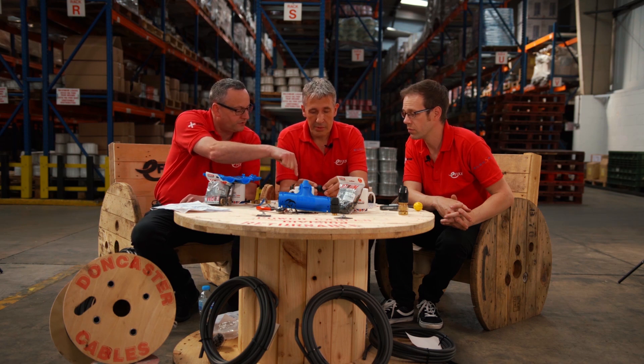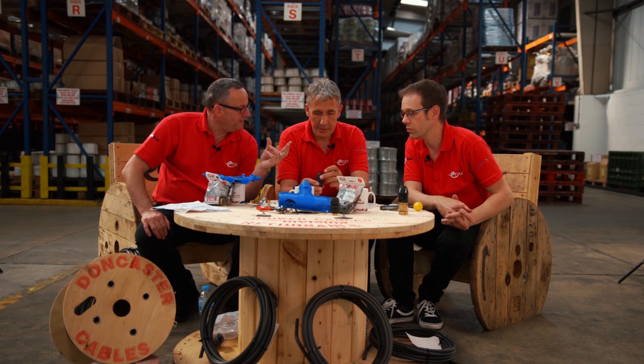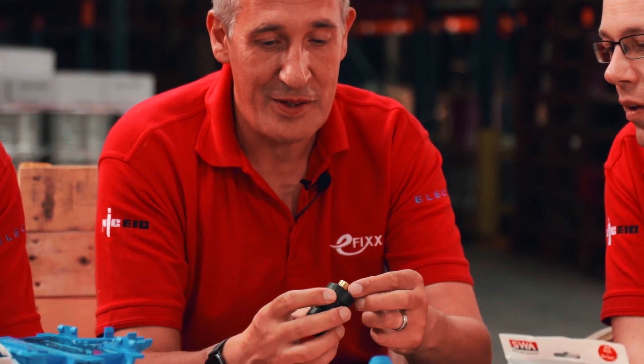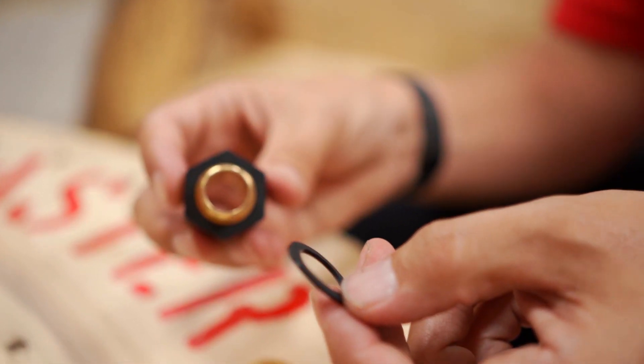It's plastic construction on the outside and comes together like a metal gland, with a very good O-ring rubber seal around the outer cable sheath and the usual bits to trap the armour. It works with steel-wired armoured cable but also braided cables, so it's multi-function. The critical component most people overlook is the rubber O-ring washer at the junction between the gland and the enclosure — the box manufacturer tests their box, the gland manufacturer tests the gland, but they don't test them together. Most glands you buy never come with that O-ring, and I can speak from bitter experience of emptying out a lot of leaky boxes.